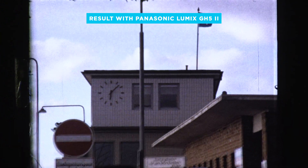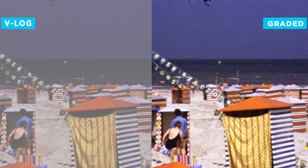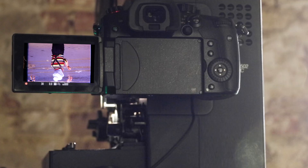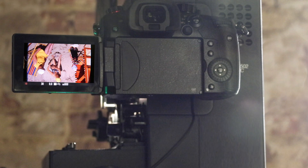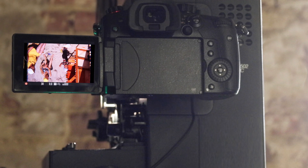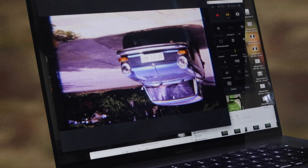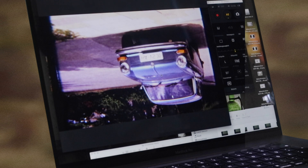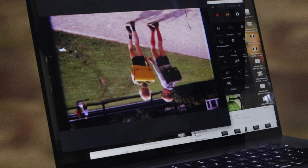The GH5 Mark II is also well-suited for our frame-by-frame upgrade, which will be released in fall and winter of 2021–22. Using an easy-to-install frame-by-frame trigger and slower projector drive, you'll also be able to work in photo mode instead of just video mode. You'll then be able to trigger an image automatically from each frame. By choosing an electronic shutter, the camera will be spared, as trips with electronic shutter are not counted in shutter count software.